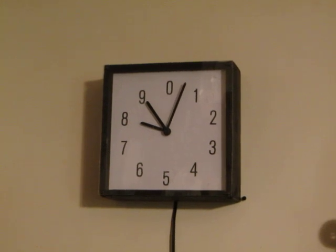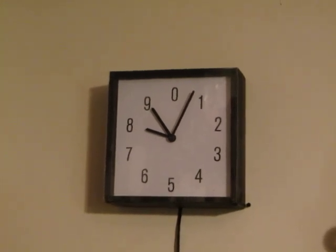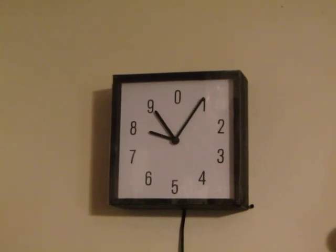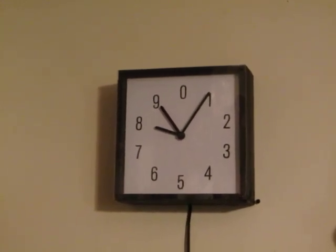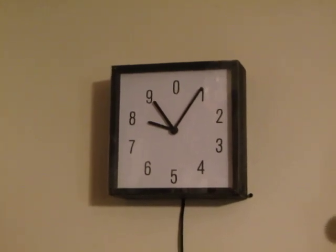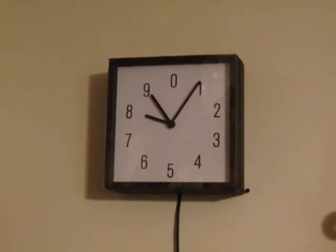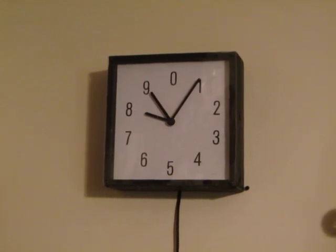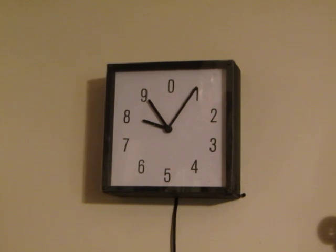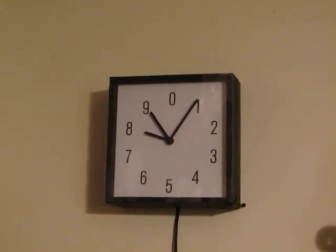And there is the decimal clock back in action. It's been out of action for a while. There was a blade spring under the three ratchet wheels which wasn't engaging properly, so I replaced it with one made from a Westminster chime hammer spring. The three ratchet wheels now move forward and lock properly, so it doesn't stop unexpectedly.